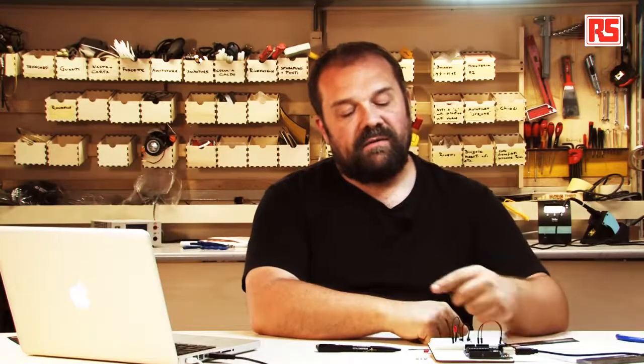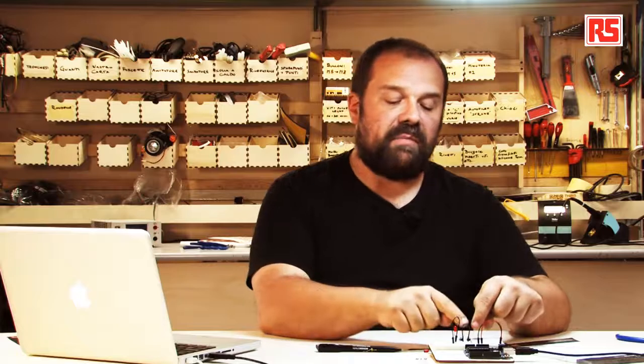So what we have learned now is that if we put buttons in series, so one after the other, I need to press all of them in order to close the circuit and make this electricity flow. Inside the push button, there are two pieces of metal that are separated by a spring. When you press the button, these two pieces of metal come in contact and create an electrical connection, and the electricity can flow through them. When you release the button, the spring pushes the two pieces of metal away and it interrupts the circuit,